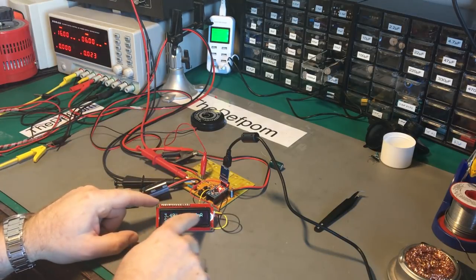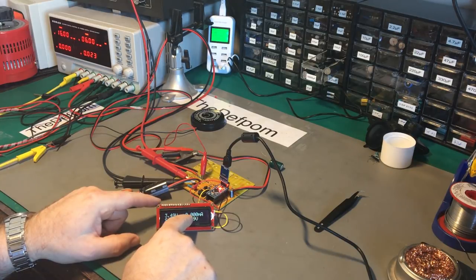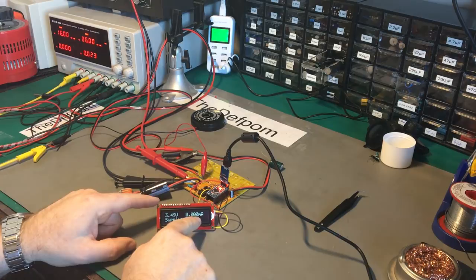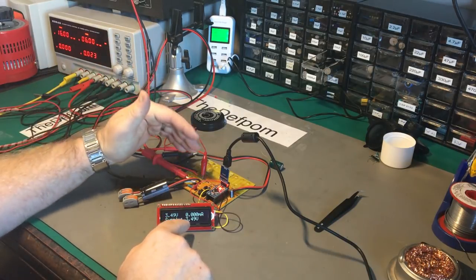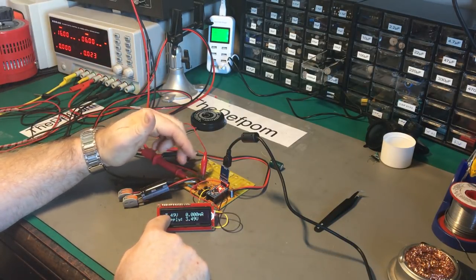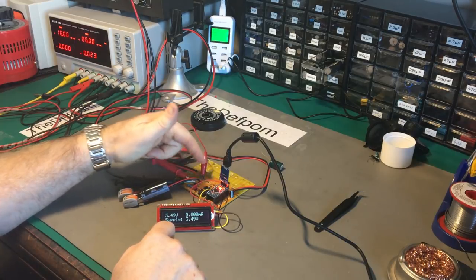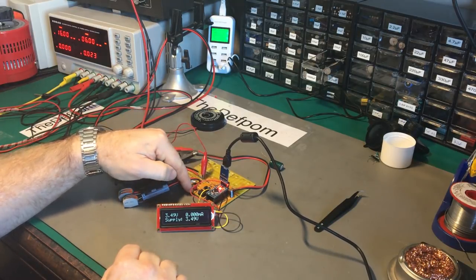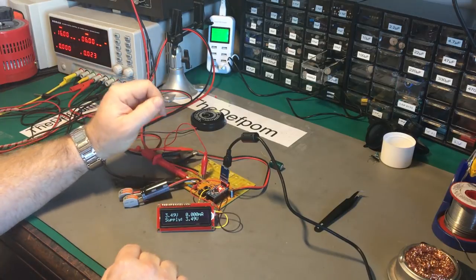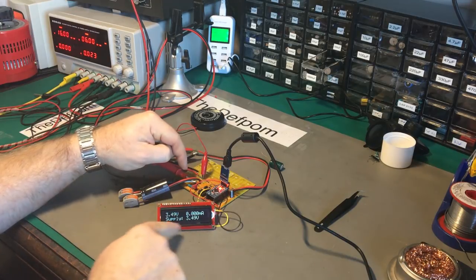You can see we've got voltage, current, and the device under test. What it does is calculate the voltage drop on the shunt resistor and deduct that from the supply voltage, since everything is zero-volt referenced. If you've got a big voltage drop across that resistor, what you're getting across the device under test isn't actually the supply voltage. I'm going to modify this to have three voltage measurement points: one for the supply, one for the device under test, and one for the shunt resistor to determine current.